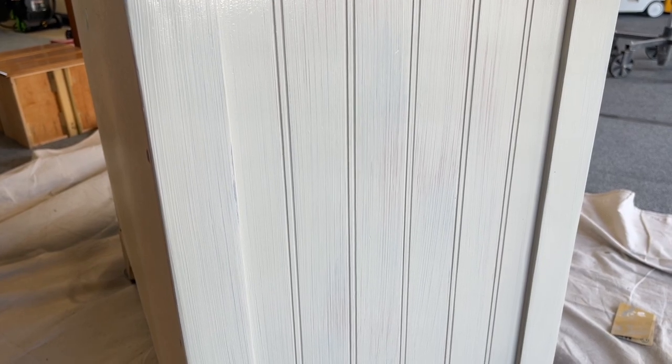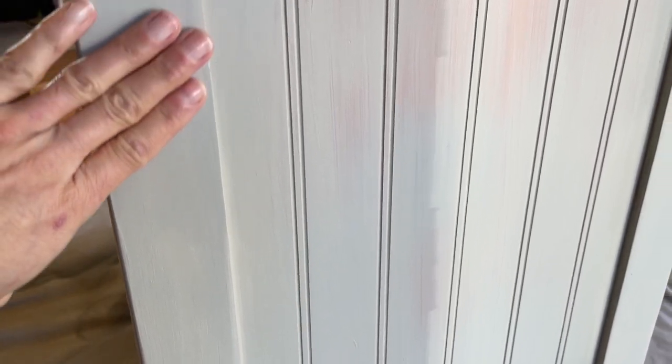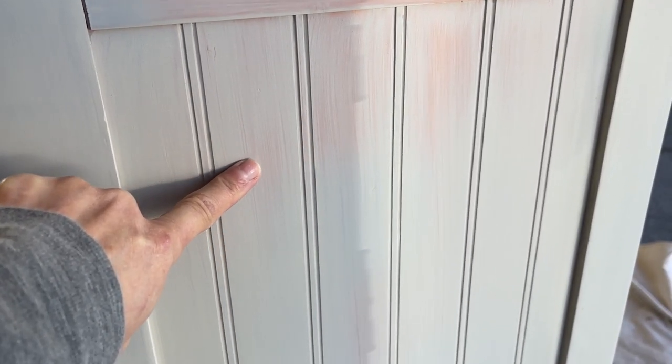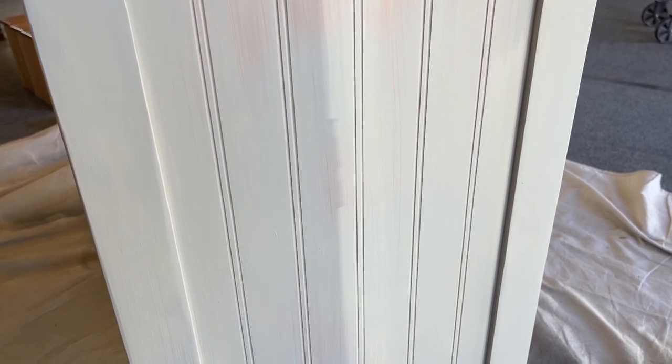Here is the first coat on. I'm not going to lie — I see a lot of brush stroking going on here, so we'll see how it pans out when it dries. It was pretty easy to put on. So this is the first coat dried down — about 45 minutes later. Normally you'll want to recoat after one to two hours depending on your climate. I have to say it's very, very smooth — I feel no texture at all. What you see is just a coverage thing; it doesn't feel ridgy or brush-stroke-like at all. So we'll go ahead and do the second coat.